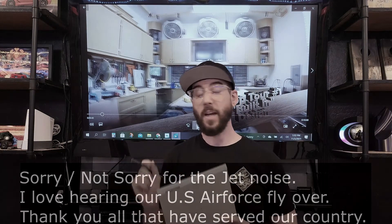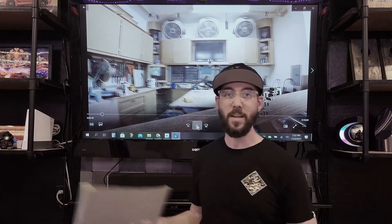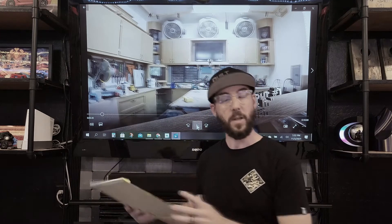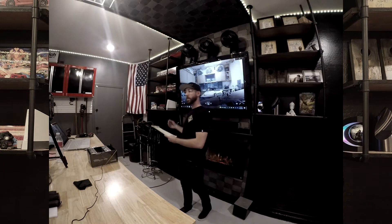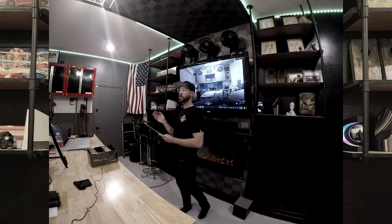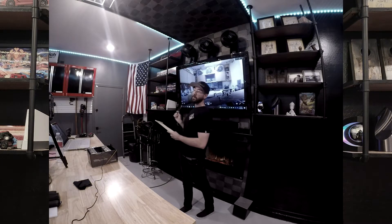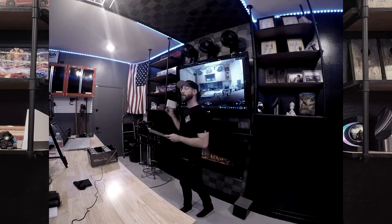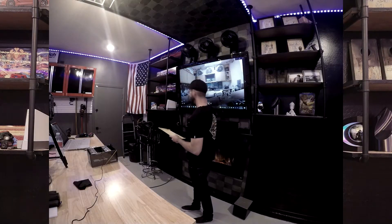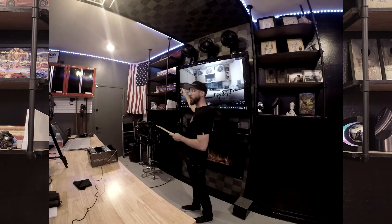I love the analogy of a tiny house because those things are so clever — everything has three uses. So you might have to be in that kind of mindset depending on how much square footage you have. Custom fits your needs; you can build it yourself for cheaper and pick and choose the materials. This was primarily two-by-four, three-quarter particle board, and half-inch particle board — three-quarter on all the base and half-inch on everything upper to be a little more light duty.